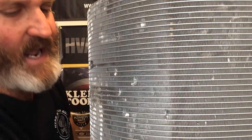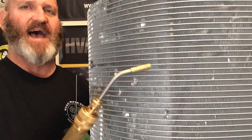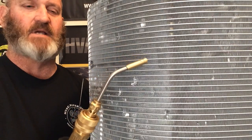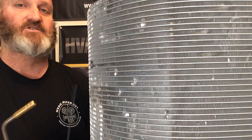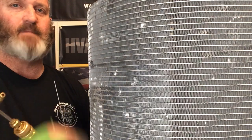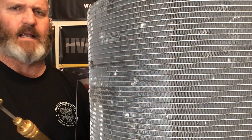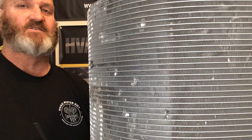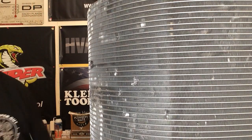What we're going to be using today is an ASCO torch with a number three tip. I love the ASCO setup through the partnership of TrueTech Tools. With the number three tip I can replicate an oxygen-acetylene flame without oxygen, and I get an awesome flame where I don't overheat the aluminum around it. Trust me on this — you're going to love everything about what you're going to see.